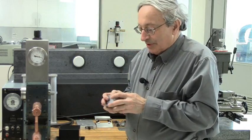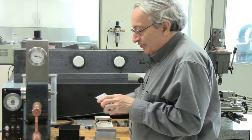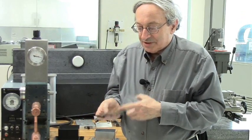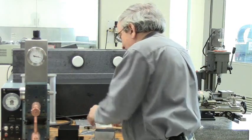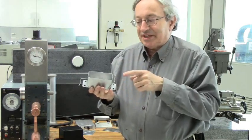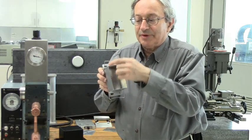Another thing you can do with water jet on enclosures or parts where you need to be very lightweight and strong is emboss them. These ribs were put in in one minute with a die made on the water jet. The die is made of two pieces spot welded together, cut on the water jet, and then you put in the ribs to make it lighter. You'll notice that I tend to design boxes made of U-shaped pieces instead of bending a piece on four sides — this box is made of a big U and two little U's which are spot welded in.